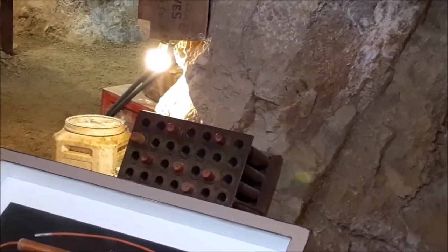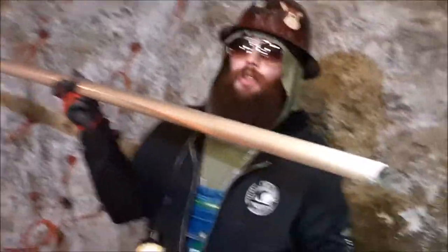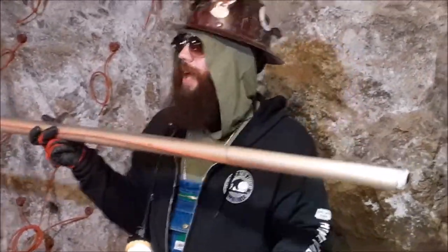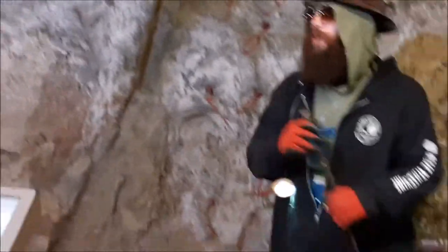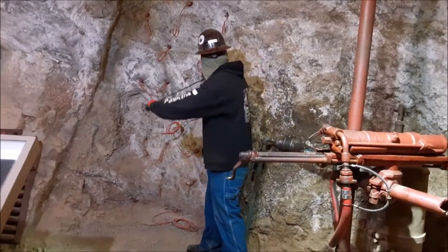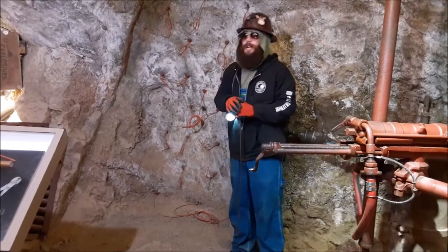When they're ready to blast, they'll bring those sticks of dynamite over here, and they'll start to fill these holes up as fast as they can, so that each one of those holes would look something just like this. Then they're going to tie their fuses together down at the middle, so you would have one long fuse that you could light and run to about where the mine shaft is from where we're standing right now, and they have to count these shots as they're going off. If for some reason they think some of these shots didn't go off or they're frozen, that new guy, the tenderfoot without the eyebrows, is getting a miner spoon. And it's his job to come back here and very carefully try and fish out any sticks of dynamite that still might be stuck in the holes around us. Any questions so far?